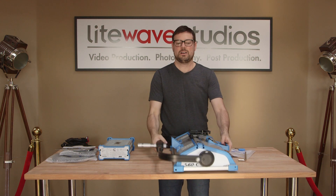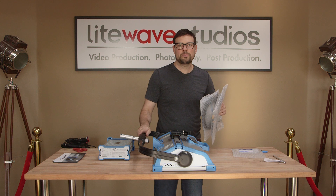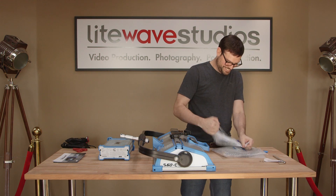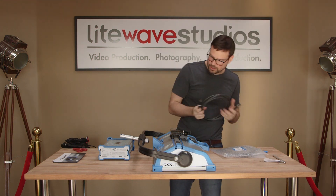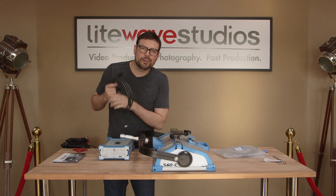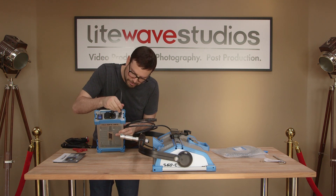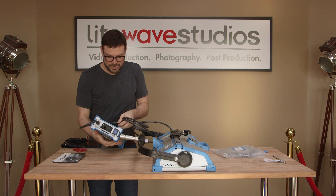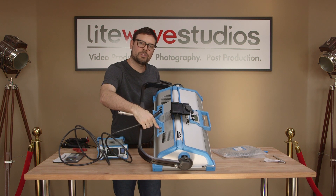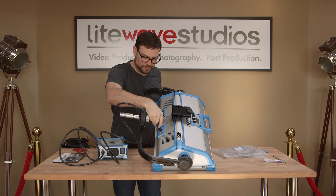This little guy is all set to roll — not falling off, that's a good sign. We've got the SkyPanel and the yoke built. Next we're going to attach the ballast cables to the SkyPanel. This is the XLR three-pin to three-pin, which is going to be for power. One side goes right in here — your power out on the ballast. We get the XLR three-pin female to the male. Inserted. Now the other part goes right into the SkyPanel itself. You also have an option for a battery, but we're just going to do the regular AC three-pin in.